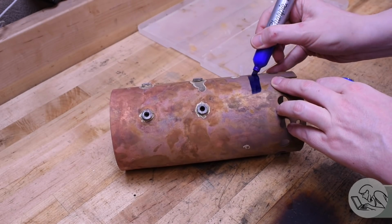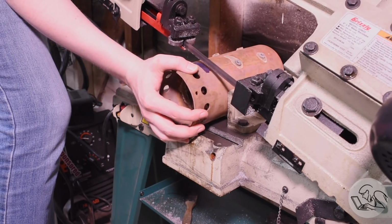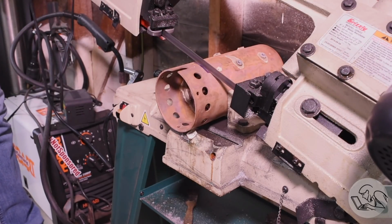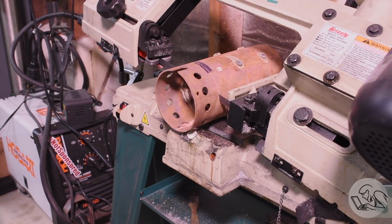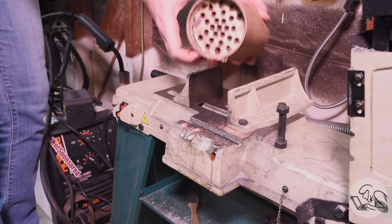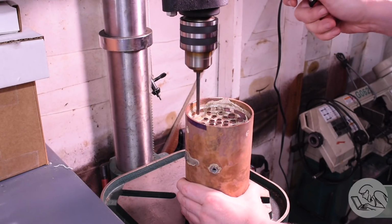So I'm going to start by cutting the firebox off. This will actually be reusable on the next boiler. The firebox is where most of the machining time was in the shell, so it'll be definitely worth saving this. So I'm going to do my best to cut this off cleanly and squarely here on the horizontal bandsaw. And bittersweet Yahtzee. That leaves just a pressure vessel, and the pressure vessel is symmetrical now, which is what I want for the next boiler because, as you recall, it was quite difficult to silver solder up inside the firebox.